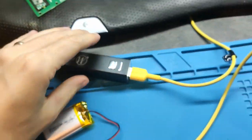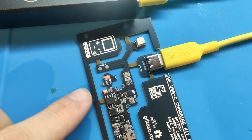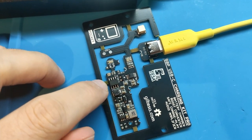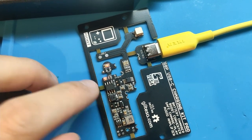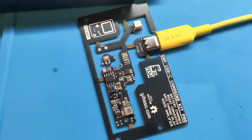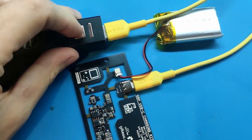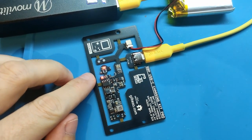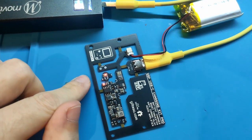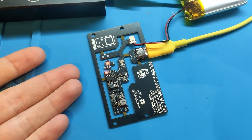However, with the boards I received, when I turn on the power, you can see how the green and red lights turn on for one second and then the red light blinks. I haven't seen anything in the documentation about this charging chip being able to blink the light. I guess it's because the resistors are wrong, and this is the chip's way of saying something is bad. And now if I connect the battery and input the power, we can see the red light turns on and stays on. However, when I remove the power, the red light stays on forever — it doesn't turn off. I don't know what is happening with the circuit, but it's because the resistors are wrong.